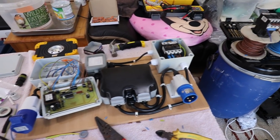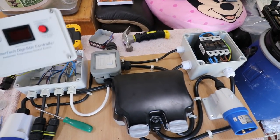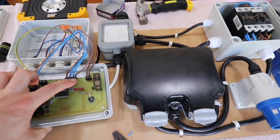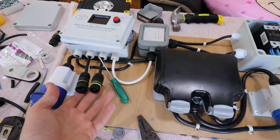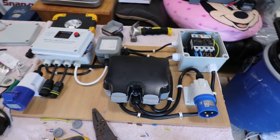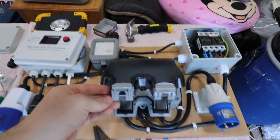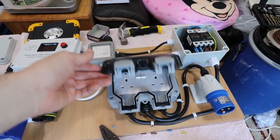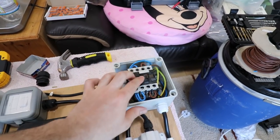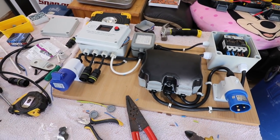Done - I've given it a quick test without fully powering up and it should work. I've wired up the flow level sensor and the thermostat and they both come to these two little removable sockets. Everything is designed to be detached - I don't want anything permanently attached to it. The only mistake is the box is a little too close so you can't open the lid fully, but it's not too bad. Now I need to get the heater wired up as it needs a bit of modification to work with this system.